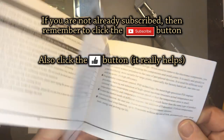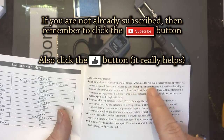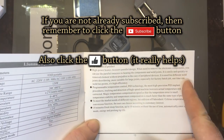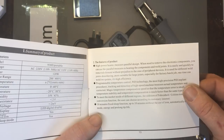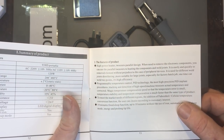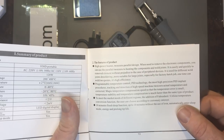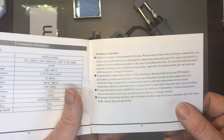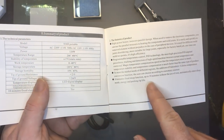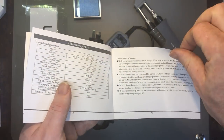The sleep mode is a nice safety feature and at least prolongs the tip life. It describes high power heater tweezers with a parallel design — you can use the parallel tweezers to heat components and solder joints. There's PID control and what's translated as 'magic temperature compensation speed.' The 10-minute fixed sleep function automatically enters sleep mode after 10 minutes without use, saving energy and prolonging tip life.